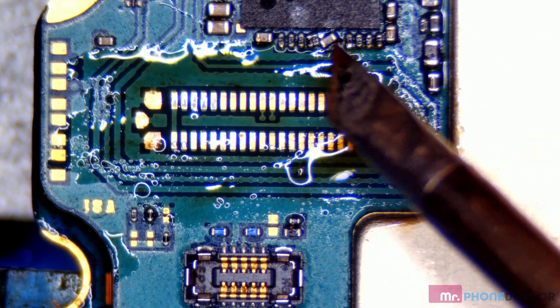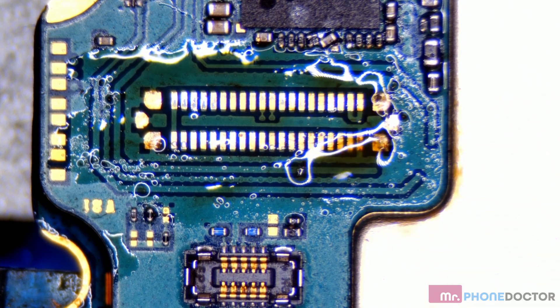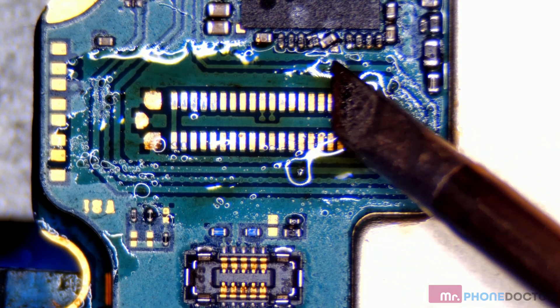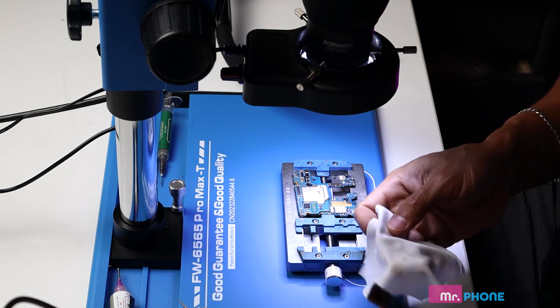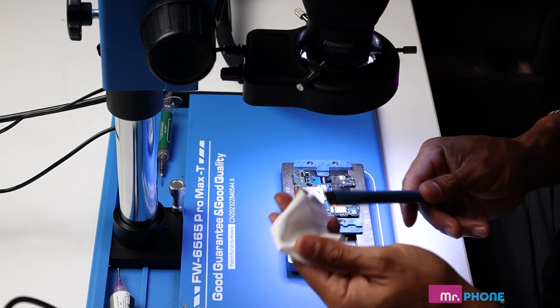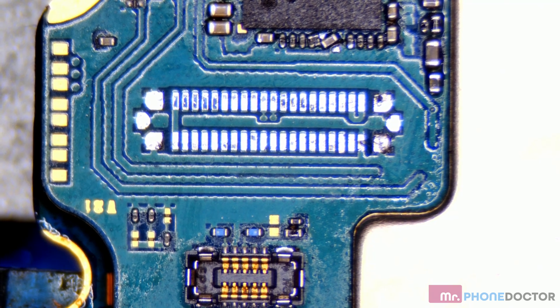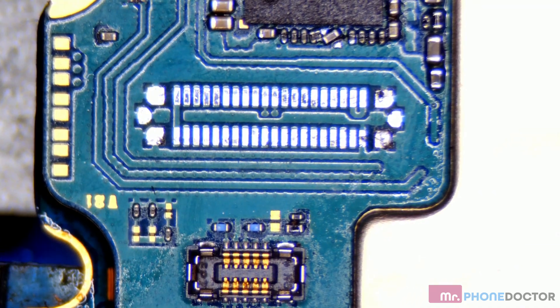I may have knocked over this little capacitor. These little guys look like they're tilted, so always be careful with how much airflow you're using. I may have been able to use a little bit less airflow to prevent that. Now that we have it safely removed, we can clean the area with some ISO using a brush and a towelette to clean the surface area. Look how beautiful this FPC connector area is — minus those little capacitors on top, it looks very nice and clean.